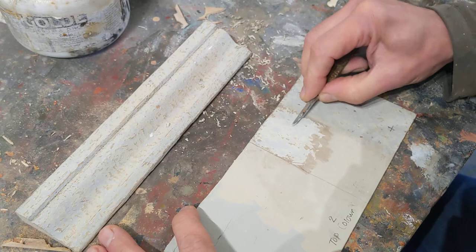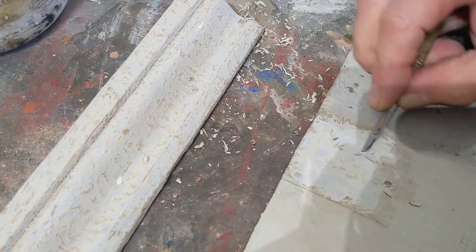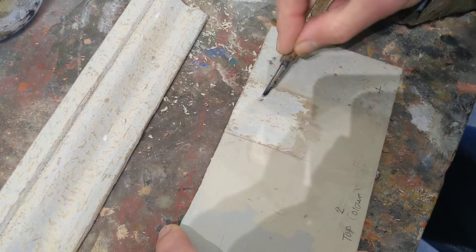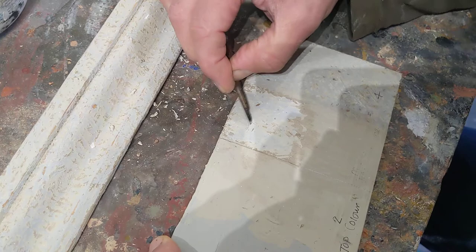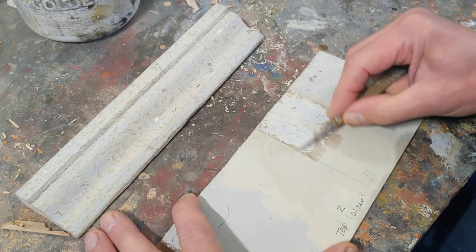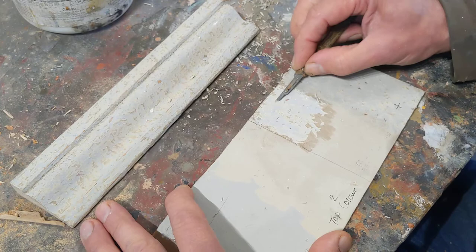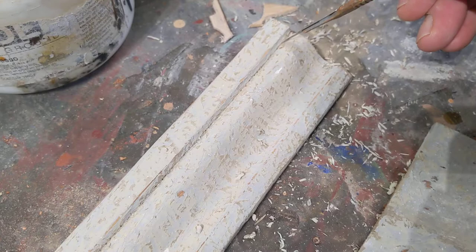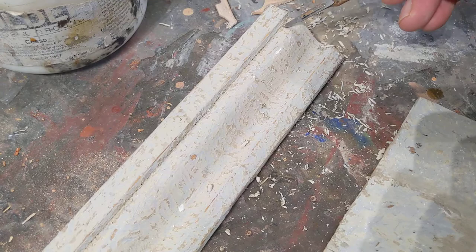Go down to the wood there. And that gives it even more authenticity and depth. Then occasionally just do that with the tip. Because that's what happens when you dry strip and it's sort of almost jammed. And that's it really — not much else I can show you. I quite like leaving it like that when it's finished. Sometimes you could put some gilding in the really low areas — in the veins of the leaves and places like that where they couldn't get it out. Because often these pieces were gilded. Nearly always. But often they were grey when they started.